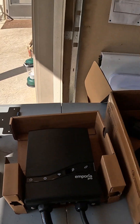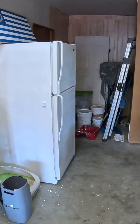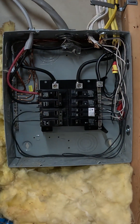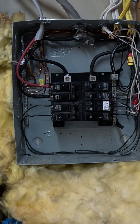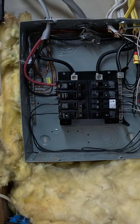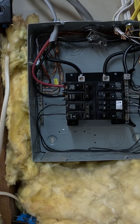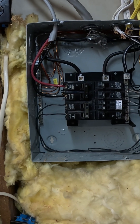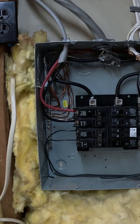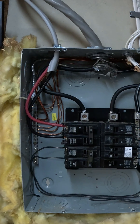What this is going to look like: we are going to go over here to the panel — this is our sub panel. We're going to be taking that lower left hand breaker out; that's not used anymore, that's an old heating circuit. We're going to be abandoning that in the cabinet, wire-nutting it off and using that spot. Then our clamp-on ammeters are going to go on our incoming wire to monitor power.